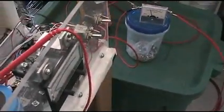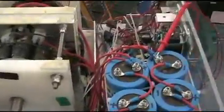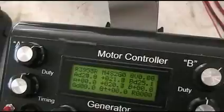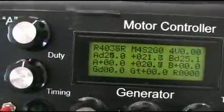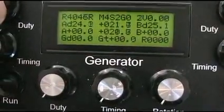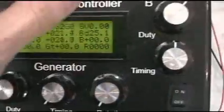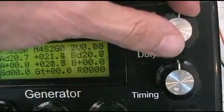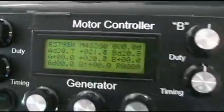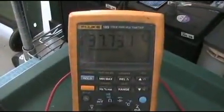I'll bring this up even more — up to 80 volts. I'm going to turn the duty down. We're up to almost 4000 RPM — there's 4000. I'll bring the duty down a little on the A side, then the B side. You can hear the rotor slowing down. Now we're down to 38 volts back-EMF — 37 volts. So it is charging.